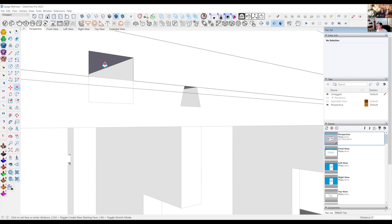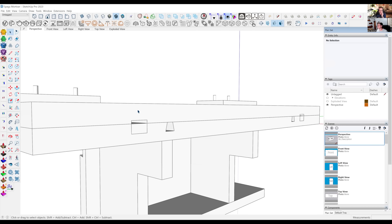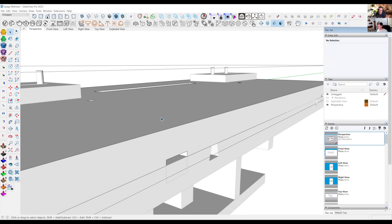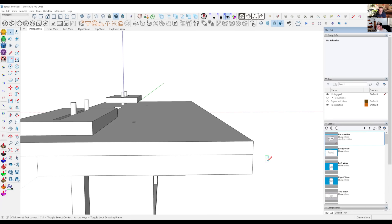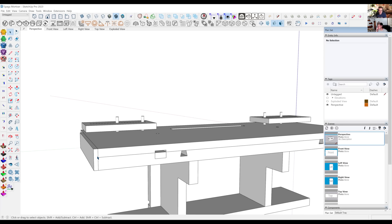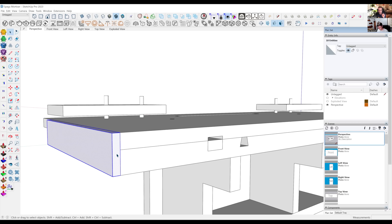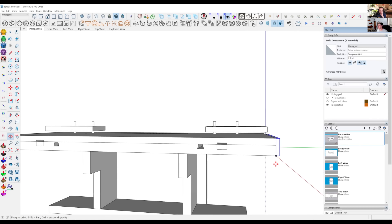Maybe a dumb question — it's all plywood. If the top and sub-base are cut exactly the same time from the exact same materials, why not just attach a strip of hardwood to the side, screwed to the bottom platform but not to the top, to serve as your guide? Is there a reason that wouldn't work? Well, it feels more elegant than runners, but you might have more of a tendency to bind — four surfaces in contact in a very narrow space versus running on the edge. If the top piece shimmies just a little bit, it could bind where runners would prevent it.